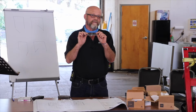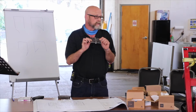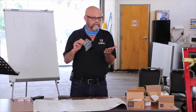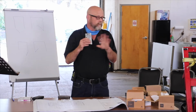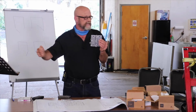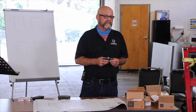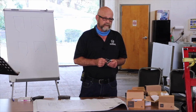You're very, very fortunate that you chose to get into the field that does hollow metal and wood doors, because we actually follow ANSI standards. Do you know what ANSI standards are? In the hollow metal, hardware, wood doors, we follow ANSI standards. So the exact same screw size for this hinge is going to be the same for the next hinge, for the next hinge, for the next hinge. Unfortunately, the aluminum industry does not follow ANSI standards. So there is no telling what you may have out there.